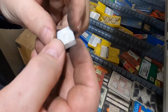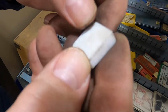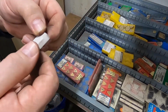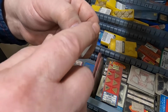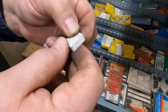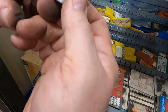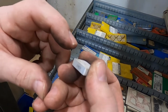I don't think the camera will show how that has just a little bit of a round in the actual cutting. The absolute sharpness of it can't be as sharp and hold up as the carbide because it doesn't have the fracture resistance. If you could make this really sharp, just like a piece of broken porcelain ware that cuts you super easily because it's really sharp, it still won't hold that extra sharpness. You need to have a little bit of an edge there that's either a 45 degree, which is common, or a radius on it. Most common is I'll just put a 45 degree. You really can't see it on the camera, but in person you can. Having that larger surface between the part starting a cut and being into the cut where the chips are rolling off makes it harder to be accurate for your final cut.